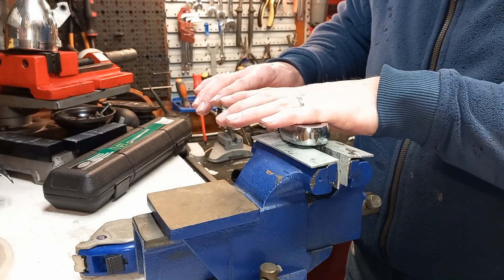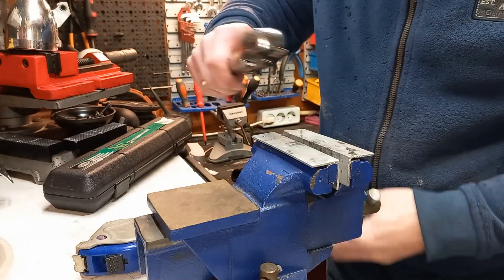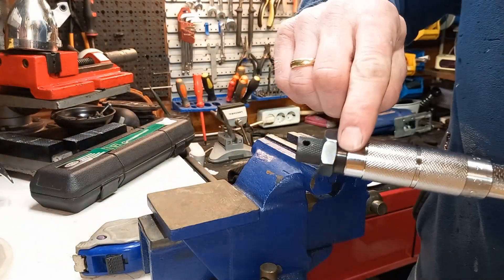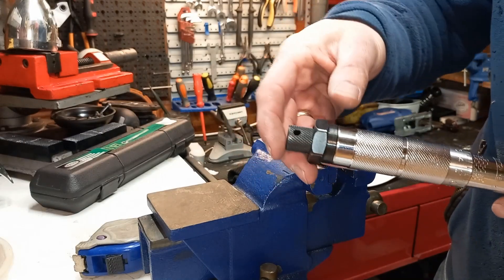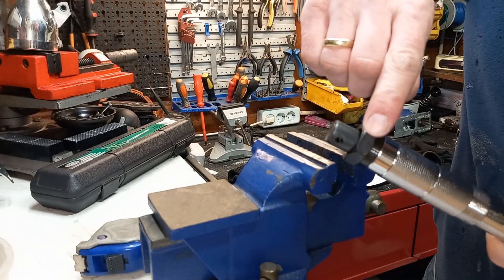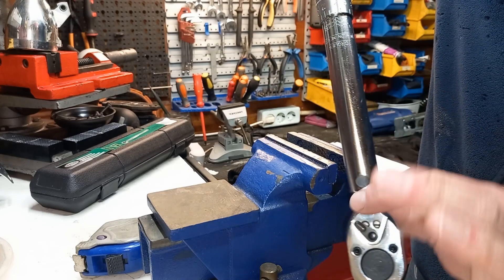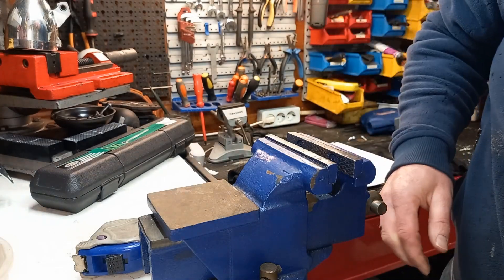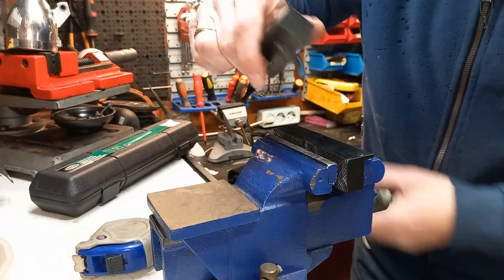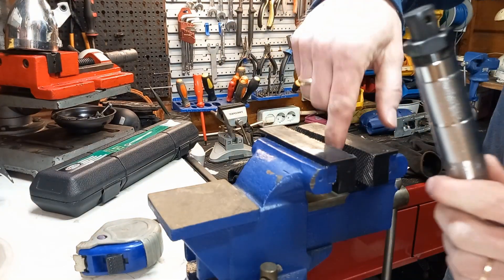I just need to know if it's accurate in the range I'm using it in. Now, for demonstration purposes, I'm going to show you how to access the adjustment screw. The adjustment screw is inside the knurled grip. The set screw turns with the grip as long as the lock nut is in place, and the set screw pushes onto the spring inside that actuates the clicking mechanism. To prevent any damage to my torque wrench, I'm going to use these soft grips.